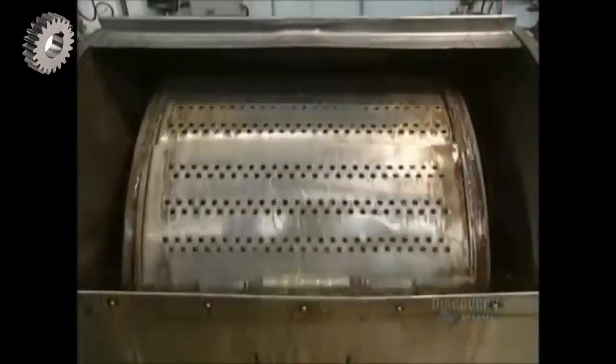They're placed in this machine, which has a large drum with 4 compartments and a 45 kilo capacity. The pantyhose are washed in soapy water, then immersed in dye. Temperature climbs gradually to 93 degrees centigrade. After a 5-minute rinsing cycle, a softener is added. This all takes 2.5 hours.